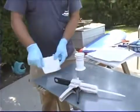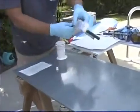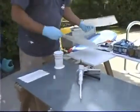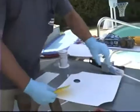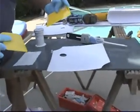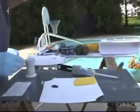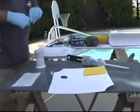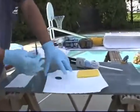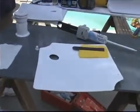We're going to use mix sticks and boards to create a patch that we're going to simulate a crack repair in the bottom of the sump or the sides of the sump. Since our patch is going to be flexible, we can mold it however we need to get in and around that material. What we have here: polypropylene mix boards. It's good to have two or three of these on hand if you're doing several patches. Also polypropylene scraper pads and spreaders — we're going to use those to smooth out and spread the patch. We also have polypropylene mix sticks for flat or radius applications. I say polypropylene because that's the only thing this stuff won't stick to — so you can reuse these parts.